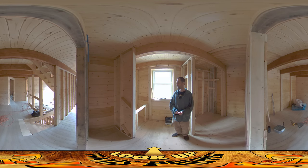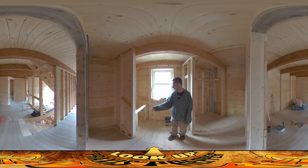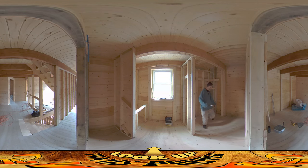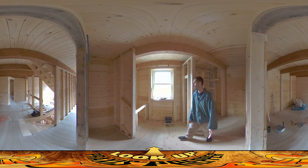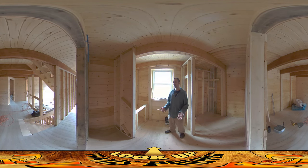Anyway, what I'm doing today is making sure there are no mistakes with the plumber — putting notes everywhere: 'no drains,' 'put your drain here,' 'cut your vent hole here,' and even a note on the shower unit saying three-quarter inch screws only so they're not going into my metal conduit. Just trying to head off any possible mistakes ahead of time. There will probably still be some, but the more of this I can do, the fewer mistakes there'll hopefully be. That's it, thanks for watching.